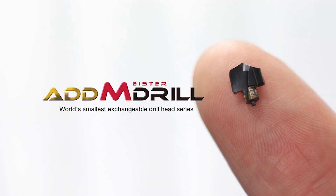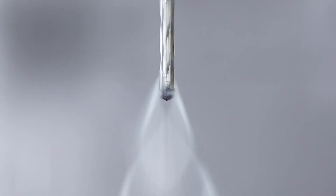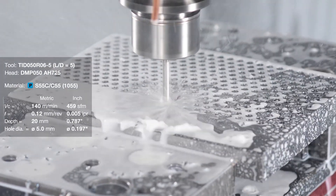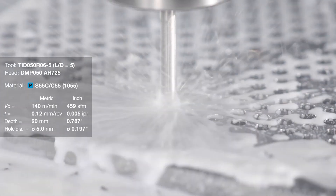We've spoken about the different sizes of heads and different lengths of bodies, but looking at the video behind me, that tool goes down to quite a small size as well. Yes, this is another new addition — with AddMeister drill, the old DrillMeister system used to stop at 6mm as the minimum diameter. We're now taking it down to 4mm diameter with a 3D and a 5D reach capability, through coolant, 0.1 increment heads, two geometries and grades of carbide.